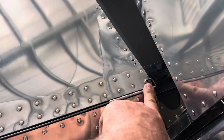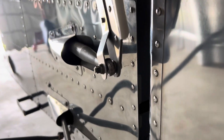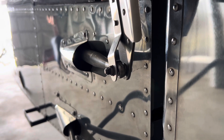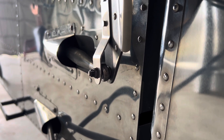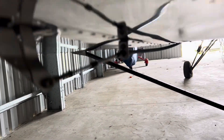Just a quick rundown on how it's all attached. So the elevators are attached via hinge, sort of like your Cessna aileron in places. The pin goes all the way along and locks off in here so it can't come out. And that's what I had a little hassle with — the other one lined up quite nicely but that one fought a little bit. And then the elevator control bolt is the wrong way. Yes, I know — I deliberately did that because I wanted the extra clearance between the control horn and the fuselage, so the nut had to be on the outside. There's a washer either side of the bearing just to lock it all in, so the bolt doesn't spin and it's all working on the bearing itself. There's the rudder trim, elevator trim — that's set up and the cable flexes with the elevator so that works well.